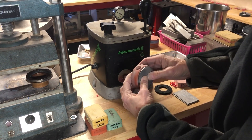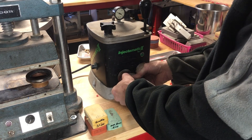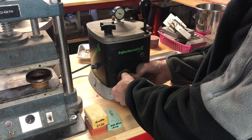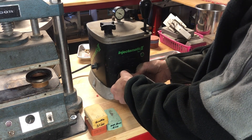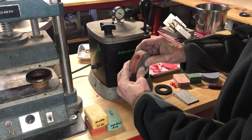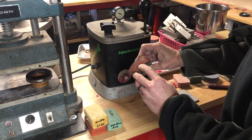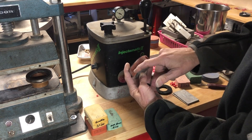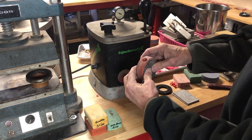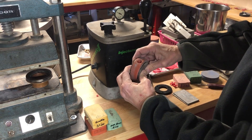You would hold this together, put it over the nozzle, and inject. I like to wait about 10 seconds — I count to 10 and then pull it back. At this point, you want to keep holding it together. Once you release it, you can start to see it separate, and you don't want that. After injecting, you want it to harden with the two sides fully compact together.